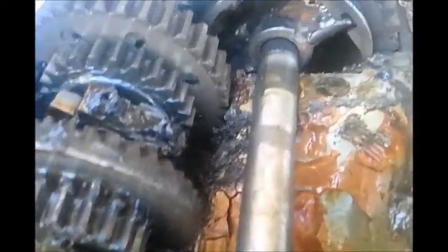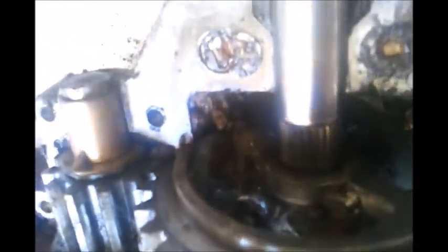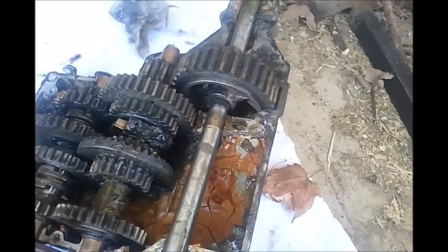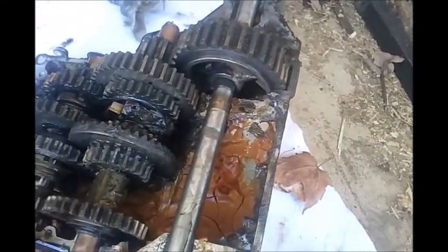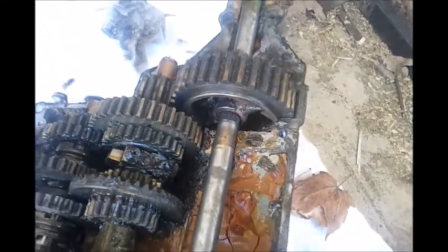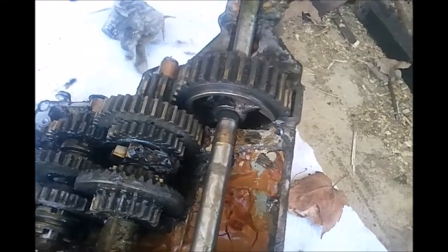Alright, I finished up the welds. I put it back in and it's fitting in there pretty good. I just need to somehow get it all permanently affixed to the shaft, and on this side it sticks out a little more than the other side, but I want to get some way of doing that hopefully in the case without welding, and then potentially taking it out of the case and welding it. So what I might do is use some epoxy. I don't know if that's a good idea or bad idea, but there's threads and roughness, those little splines on there. So there's threads inside that coupling and splines on the outside of the shaft. It may or may not work.